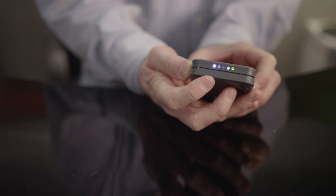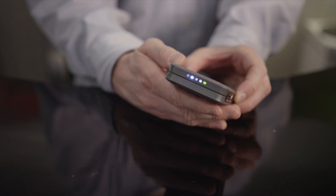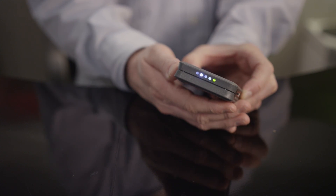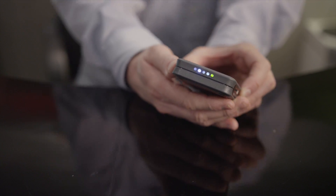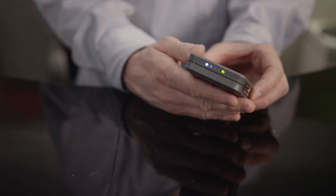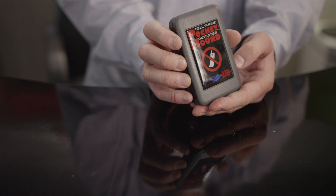Push in the button to check the threshold mode. If the blue LED to the far left is lit, you need to scroll down to select manual threshold — the second blue LED from the left will light up. Push the button to select manual threshold mode. Now if there is no nearby cellular activity, you will see no LEDs lit. To begin detecting cellular activity in this mode, press the thumb wheel so the blue LEDs turn off. The Pocket Hound is now ready for detecting cellular activity. Remember, the Pocket Hound will not detect any cellular activity until after you press the thumb wheel and exit this mode.